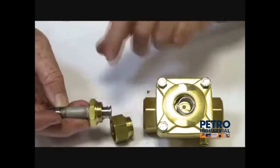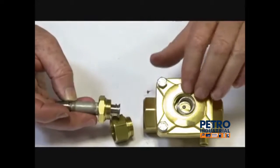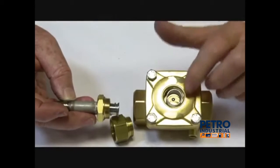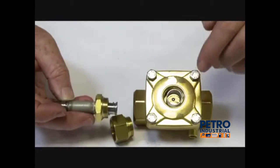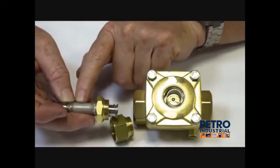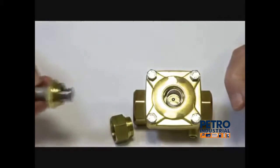Because the pressure increases on the top, all we're doing with this valve is opening and closing an orifice inside here which allows the unit to vent off the top. Media pushes the diaphragm up. When the valve is de-energised the liquid flows through here, which then changes in the opposite direction.